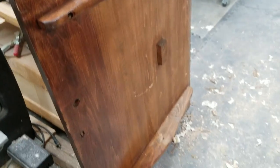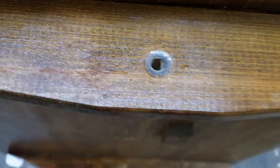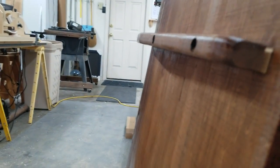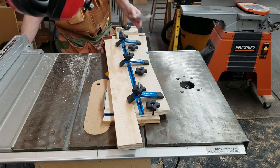Our braces under the table would be the same design as the originals except longer. Each brace had six holes for sunken screws plus holes to mount it to the frame and to attach the locking hinge. Each brace was three inches wide in the middle, tapering down to one and a quarter at the ends.